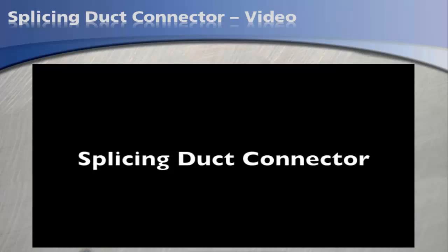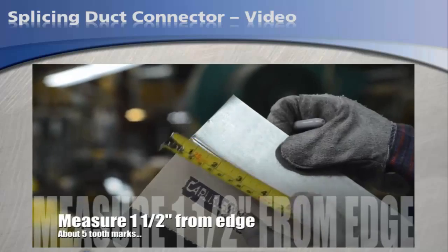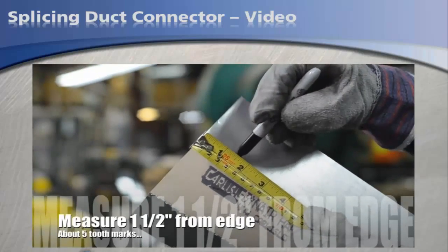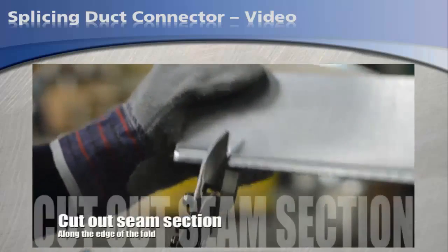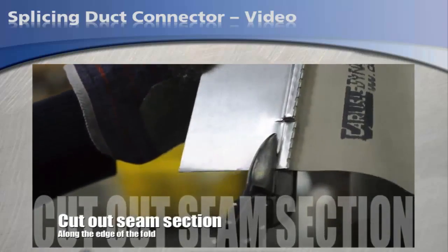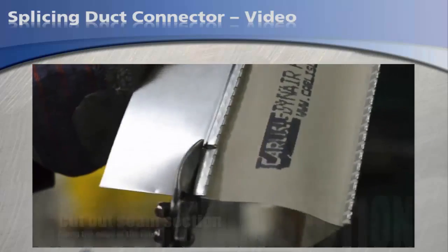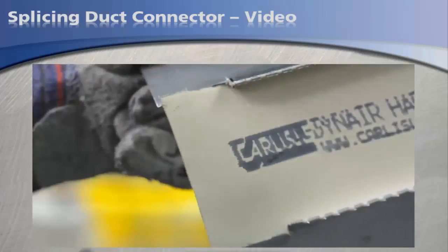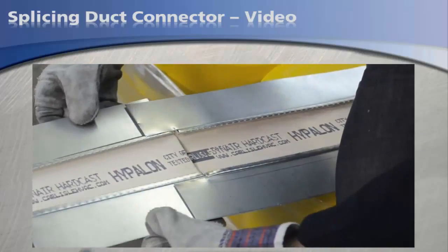Today we're going to take a look at splicing duct connector. Now your first step is to measure 1.5 inches from the edge of that connector. Now that's equal to approximately 5 tooth marks on that seam. You then want to cut a notch and then cut right along the edge of that offset seam. Once you've taken out the notches on each side, what you're left with is a piece of connector that can then mate up to the other section.